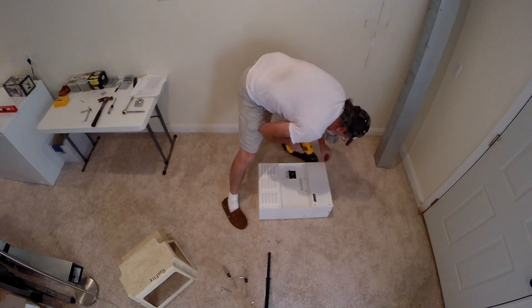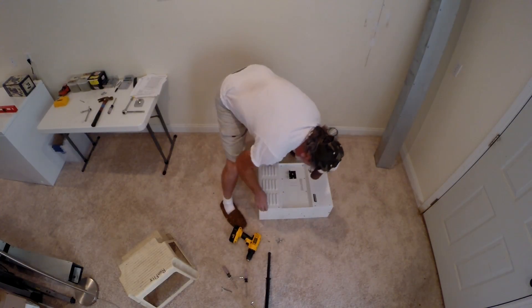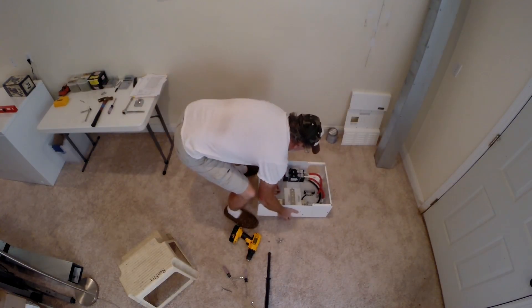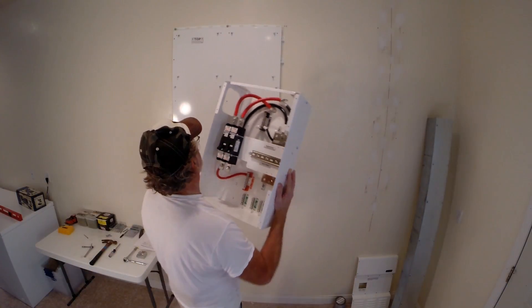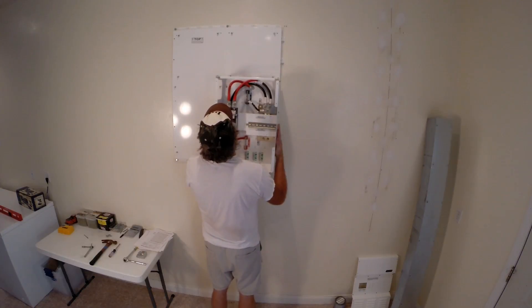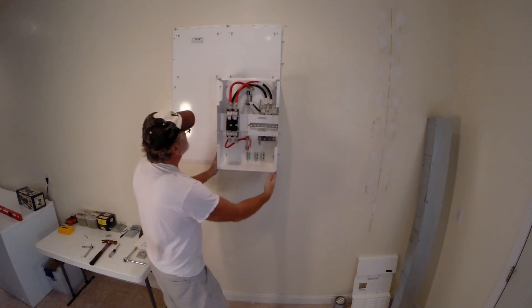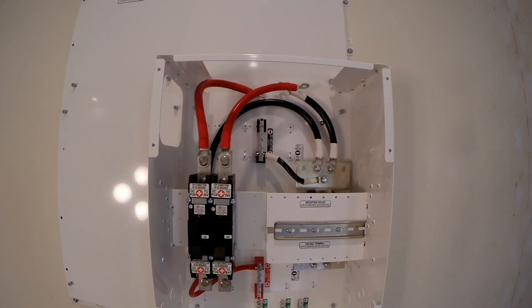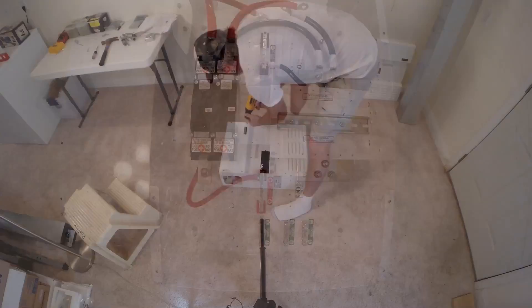This is the DC side — just taking the cover off here. The DC side is where you bring the battery power in. It's where you bring the PV from the solar in, and the output from the charge controller runs through there to charge the batteries. That just hangs right on that backplate. And there it is up close — you've got a DIN rail for adding more breakers, so you can use breakers on the inputs and outputs of the PV and charging.